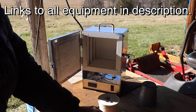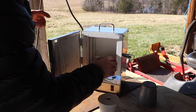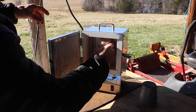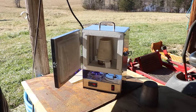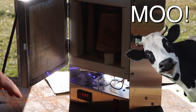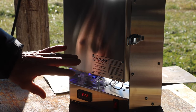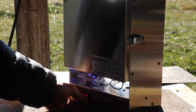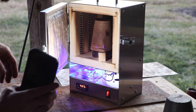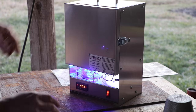This is just a little electric tabletop furnace. First I'm going to dry out the mold — just going to do this at 100°C for a couple of hours. I'm going to invert it over this pan because as I raise the temperature, the plastic's going to start dripping out. I've been at around 240°F for the last few hours, so that should have driven off all the water in the mold. We are going to go up to 450 degrees now, and then it's been at 450 for several hours — so we are going to take it up to 1200.